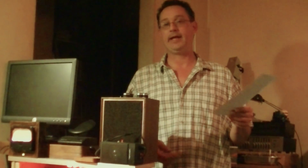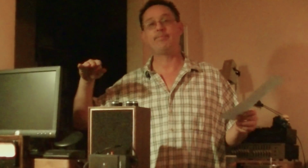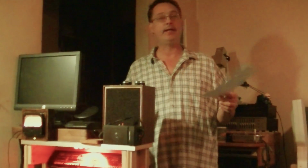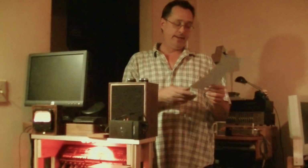The resistors you're going to be looking for are R36 and R37, which is ironic because the original part value is a 36K and the part number is R36. Now, according to the forum thread, a 26K, lowering it from the stock value of 36K to a 26K, gives you a perfect balanced match between the dry and the wet signal. If you were going to cut a 24K in, it'll give you a little volume boost. I had a 27K, a 20K and some 22Ks.